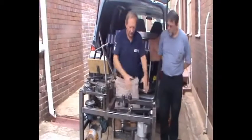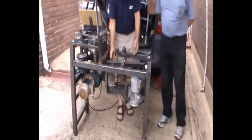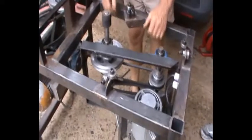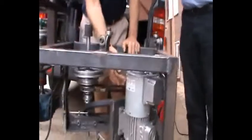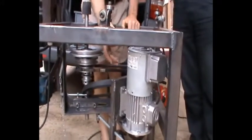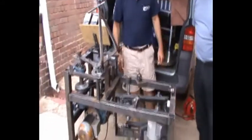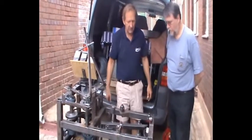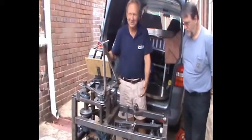Here is the drive underneath with the gears for the turntable. It's got four pulleys here, two pulleys there, giving eight gears. In addition, here are the pulleys at the bottom, and here is a six-pole motor which you can run with a frequency regulator and change the speed. Because it goes slow, it's got a forced fan which runs continuously on top. So we can run it from 50 hertz down to maybe 10 hertz or even lower. From 20 hertz down it will lose a little bit of power, so that's why the gears are there — it's like a motor car. The speed control is like your petrol, but you still need gears; otherwise you drive in one gear all the way.